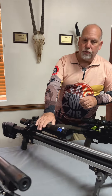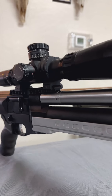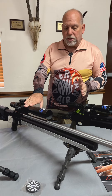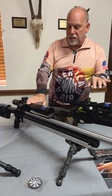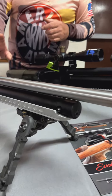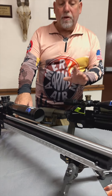In the same line we have the 223, also aimed at NLR, steel scramble, or any kind of the slug events for air guns. The caliber is actually 223, not 218. It's designed for slugs — we shoot a 43 grain slug at right around a thousand feet per second, so the energy is in that 90 foot-pound range. This is a new bull barrel from MOA Barrels and it is a five-groove cut-rifled barrel — very precise, very accurate, and very rigid.